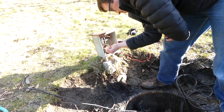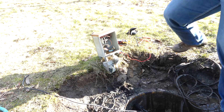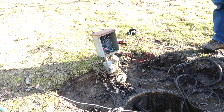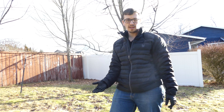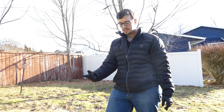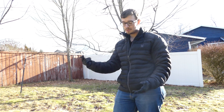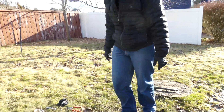I think those wires don't all need to be there because the float switch is spliced right here. We need to cut that splice open and see what's in there, then hook that pump directly to power and see if it does anything. To recap: that control box isn't really in play anymore — it's just used as a junction box. Old wires from a previous pump and float land in there, but it looks like they're just running power straight through the box into the float, breaking a leg from there, and firing the pump that way.